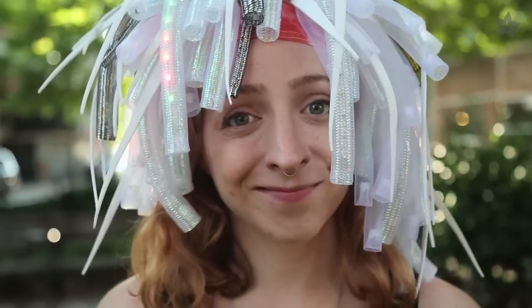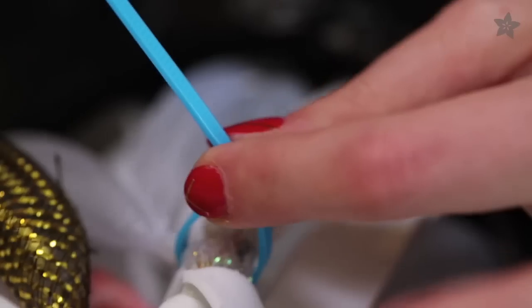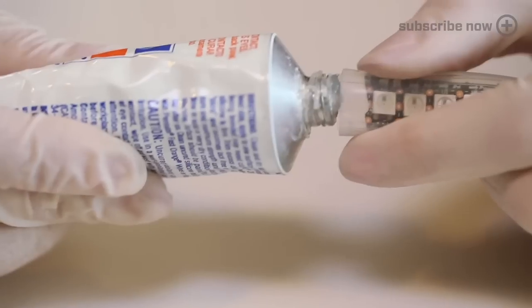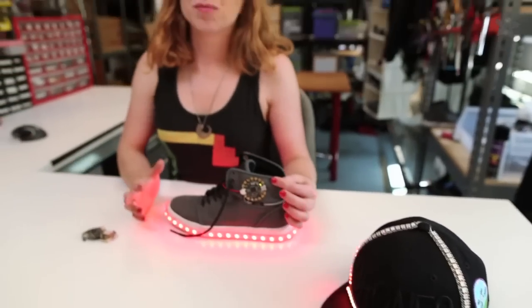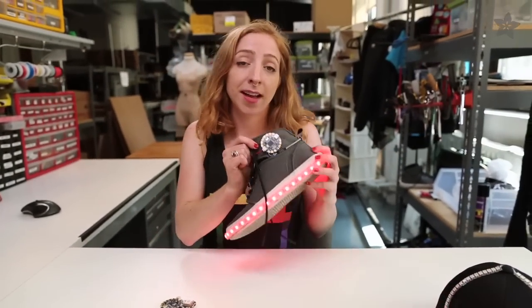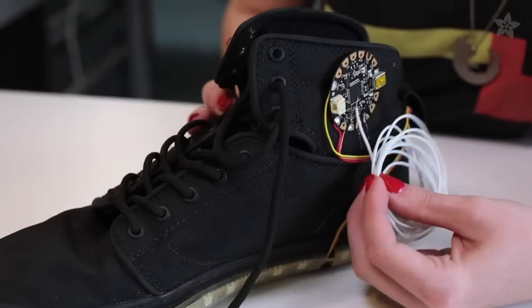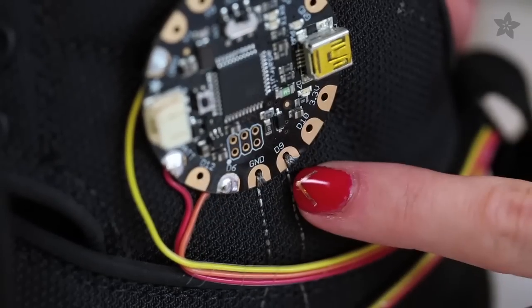The first C is construction. The mere layout of your components can do a lot to strengthen your build. Provide strain relief to wires using glue, zip ties, or stitching. Select LED strip and pixels with weatherproof silicone sheathing, and use silicone adhesive to seal everything up. Position your circuit boards in places on the body that don't bend or twist too much, like the sides of a shoe or the lapel of your jacket, or inside the rim of a hat. The less physical agitation your circuit experiences, the better. If your circuit might experience dust or body humidity, you may want to use thin, flexible silicone-coated wire instead of conductive thread. Soldered connections are less likely to get gunked up than sewn ones.